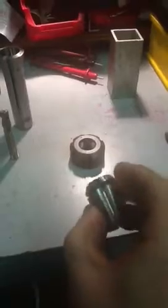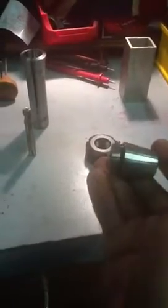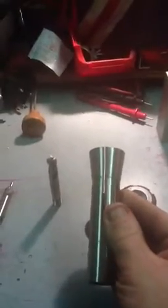What I use are ER collets, like this one here. The special thing about ER collets is that if you look at them, you'll see how the splits in the collet — there's some that come from the tool holder end to almost to the tool end, and the alternating ones go from the tool end almost to the tool holder end. That means, as opposed to a normal R8 collet, where the splits only come from the tool end to the tool holder end.